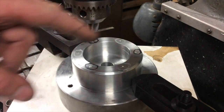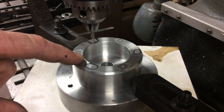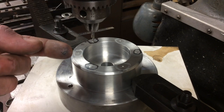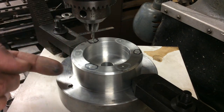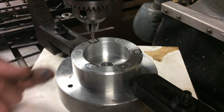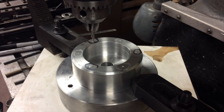We're also going to drill two more holes between two of these holes with a number 7 drill bit, so we can run a quarter-20 tap in there. That's going to help us push that QD coupling out from the back side — once we draw that coupling in there it gets pretty tight, and to push it back out, if we tap some holes, we can use the same bolts that we draw the coupling in with to then push it back out. You'll see how that works in a little bit. I'll probably just fast-forward you through the drilling — you've seen it enough, it's standard drilling from here.